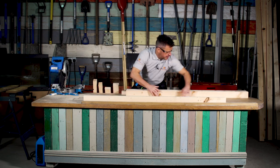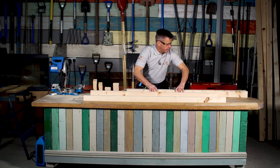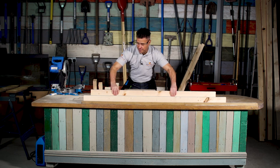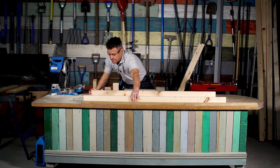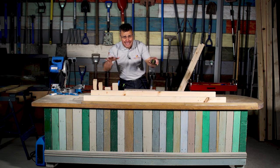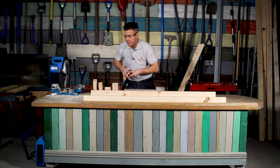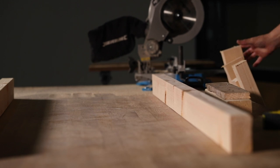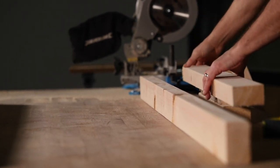I'm going to place these two here and put them aside for a moment. I want to create this frame to be 600 millimeters wide, because the fire itself is going to stand 600 millimeters off the floor. I want to cut four more sections at 510 millimeters, using these off-cuts.